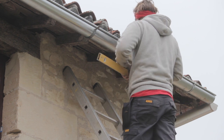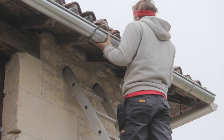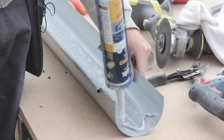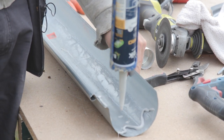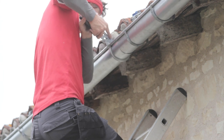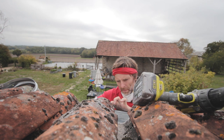The pitch of the roof was deceptive. I decided to measure the pitch by eye and place a spirit level in the guttering as I went. This is certainly time-consuming as you're constantly up and down a ladder, tightening and loosening the nut on the brackets. However, using a string line was never going to work because the roof was so uneven. I used adhesive for the zinc guttering to glue the two pieces together — this is the non-soldering technique, which is not common in France. I used another type of bracket on the join to act as a clamp. You can also rivet any joins if you feel they need more support.